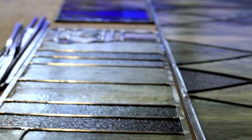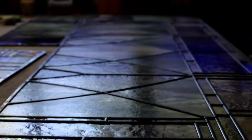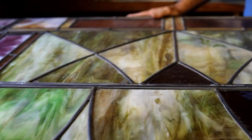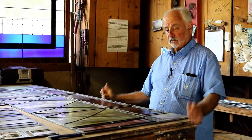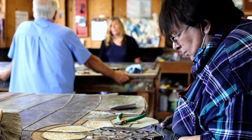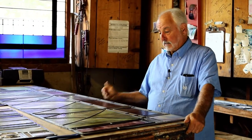These are panels of the large window that are already re-leaded. This one still needs to be puttied and cleaned. The process is like a puzzle — you put a piece in, put lead around it, put a piece in, put lead around it. You have to make sure the miters and all the joints are tight, and then we solder each joint together — lead is solderable. Once we get it all complete and sized to the correct shape and size it was originally, it's a putty process where you embed putty into all the lead. Then after we putty it, we polish it and get it all clean like this.